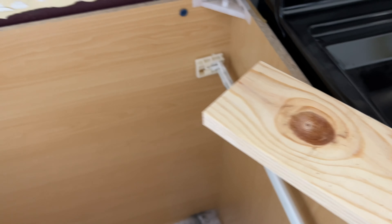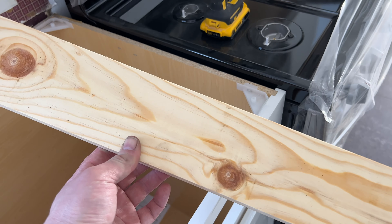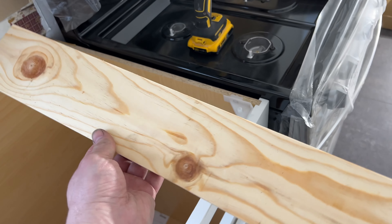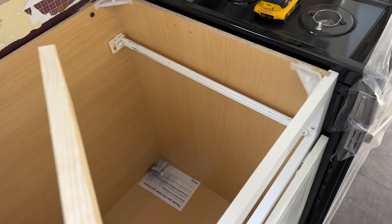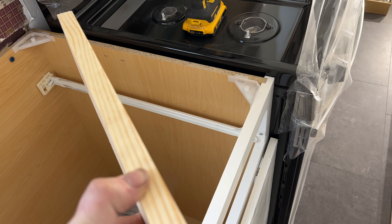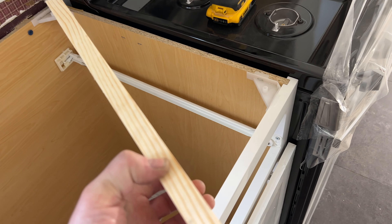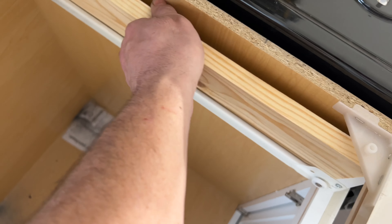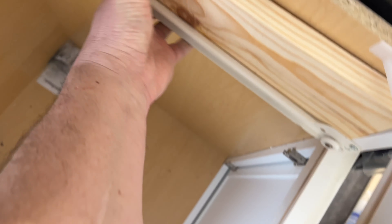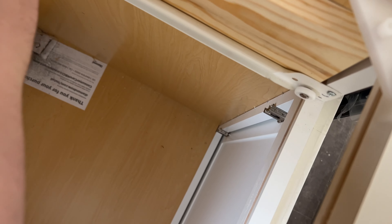Here are the existing slides — the ones that are total garbage. You've already ripped your boards down or bought them. At 22 inches, the actual dimension equals three-quarter inch. If you're not familiar with wood, if it says one inch at the store, it's actually less than that — it'll be exactly three-quarter inch, and that's all we need to slide in between here.